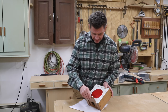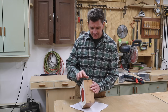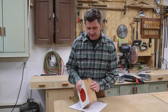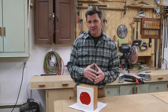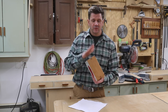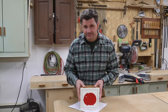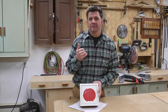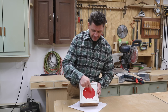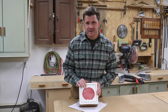The door works like a sliding dovetail for getting the money out. It's just a simple box — I used this as an opportunity to practice my dovetails, but you can build the box with butt joints, box joints, miter joints, really whatever you want to do. It's a fun little project for practicing your woodworking. If you want to build this box to the exact measurements, I'll have them on my website along with an image of the pig you can print out, cut out, and use as a stencil.